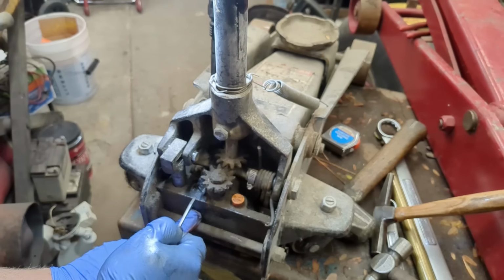But on the top, well, back here we have the piston that pumps, the smaller piston that pumps up the fluid through here. This is our release. This one right here is our safety do not touch thing. If I remove the cap, way down in there, there is a screw with a spring that's adjusted the pressure to exactly 3 tons on the lifting arm. You see those 2 little slots? And I don't know if you can see, the whole sidewall is threaded. And so that just threads down on a spring and a check ball. What this is lifting is probably 30 tons, like I said before.